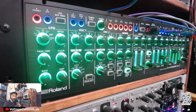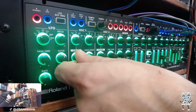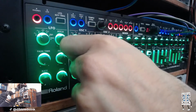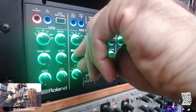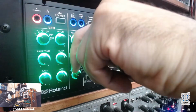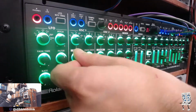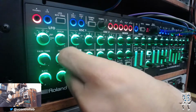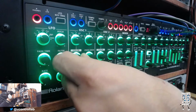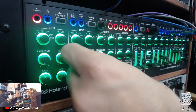We have the ramp or saw and square modes here. The color knob really controls sort of the pulse width, in a sense, on both of them. Not really pulse width on the sawtooth wave, I should say, but it's more like a sync function. Has a similar tone, though.